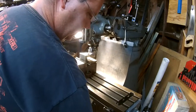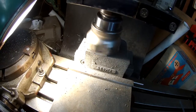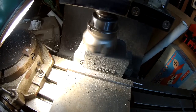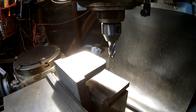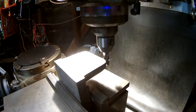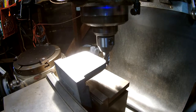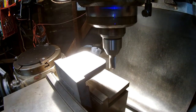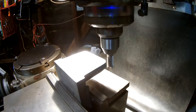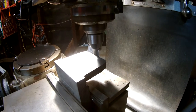This is a three-inch diameter face mill. The cutter appears to be doing a really good job - good chip formation and it doesn't appear to be chattering. I've switched over to a half-inch four-flute solid carbide end mill to mill one of the flat edges along the back. Touched off, and since this is a really sharp end mill the chips are coming off really well - good sized chips, which is nice.